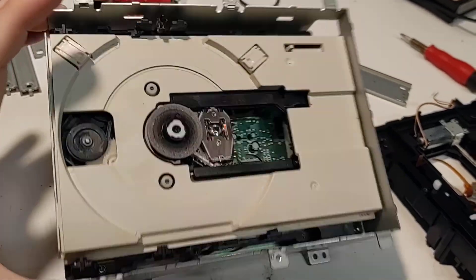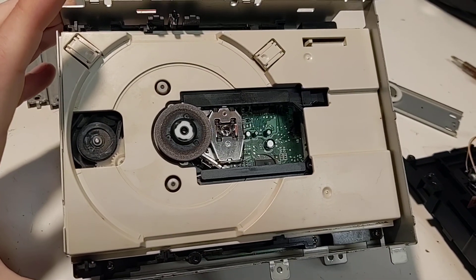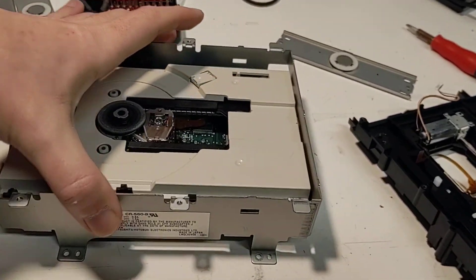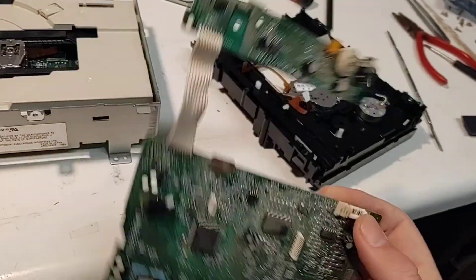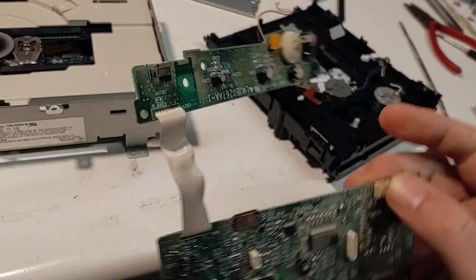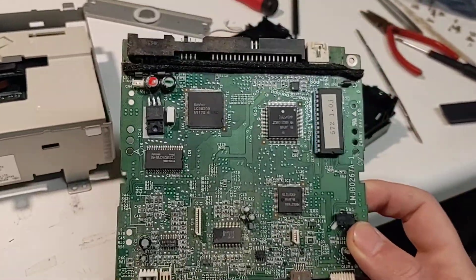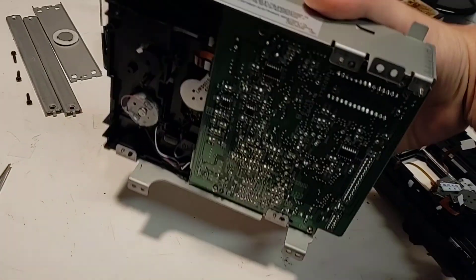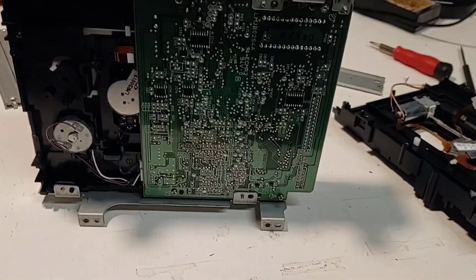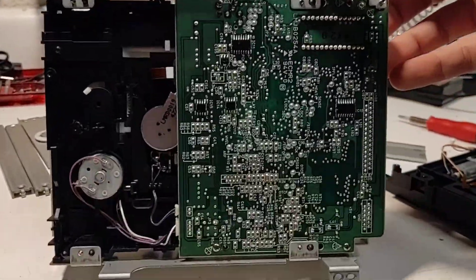As you can see, the bottom is covered up here, but it's the same exact lens — the SF92.5 or 925 — and the same exact ribbon connectors on the motherboard. Here is the same. Here is the old motherboard that was in the drive. This little front piece was for a headphone jack and a volume jack on the front of the drive. I took this old drive apart, unhooked all the connections from the old motherboard, took the motherboard that was on the 3DO drive, and transplanted it in here. All the wiring and connections are one-to-one with the original board — absolutely no difference whatsoever.